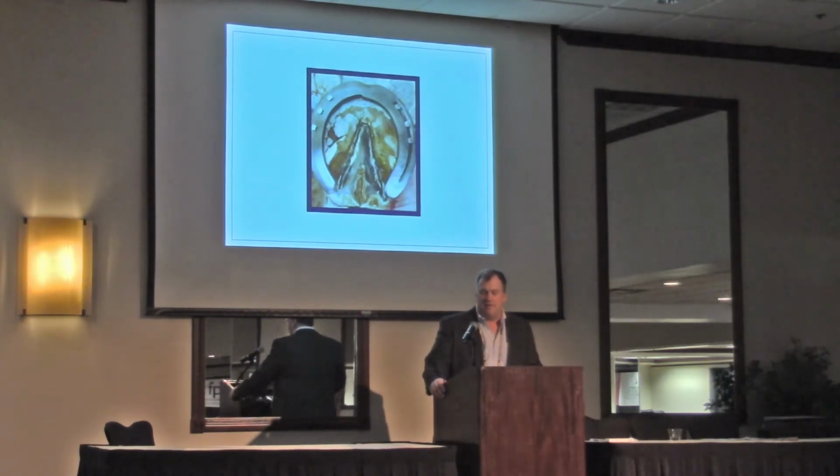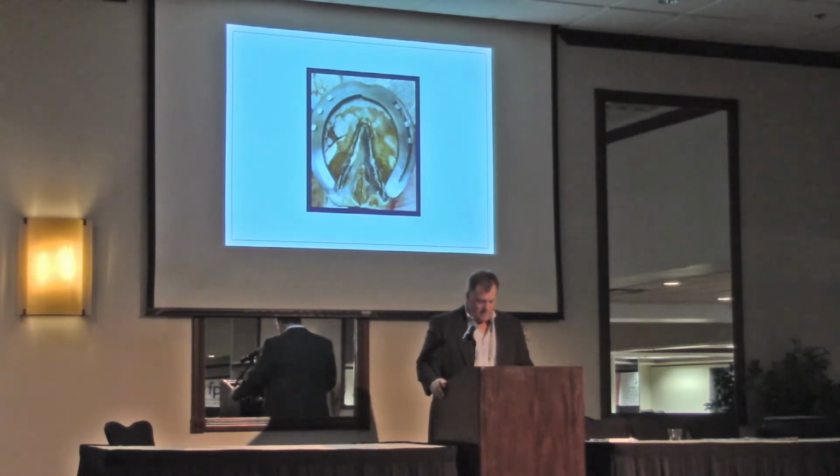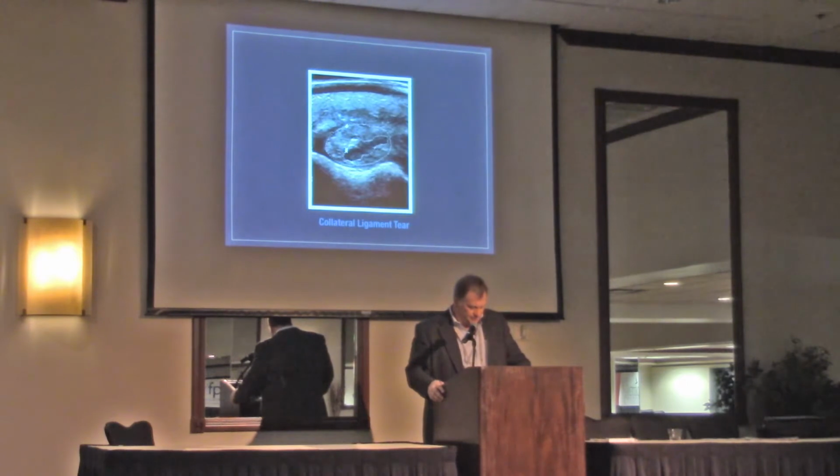I don't try to get them to land flat or whatever. I just try to get them to miss that, just to take a little bit of that compression away. So when they come down, they miss it with the bevel on the left-hand side here. And I would rasp those nail heads on.